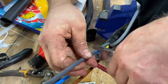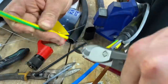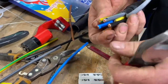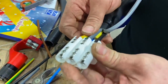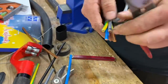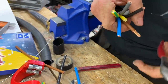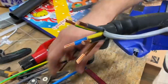We need to make sure our connector is in the right form - three at the top and two at the bottom. It's vitally important that we lay our conductors correctly, because on the first side we do, the second side has to match it. There really isn't room to route the cable to a different connector and cross them over. This connector block is handed - it has to go three at the top and two at the bottom, because there are locating pegs at the bottom that will sit within the gel joint.